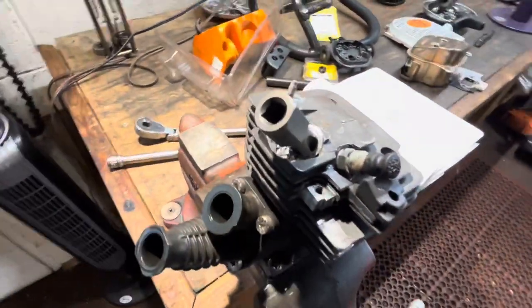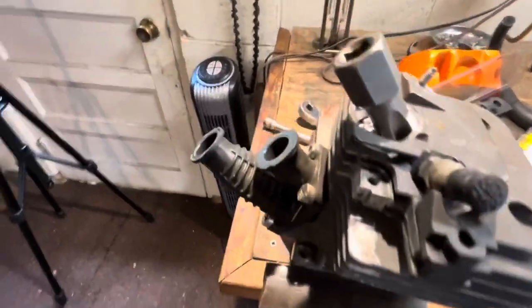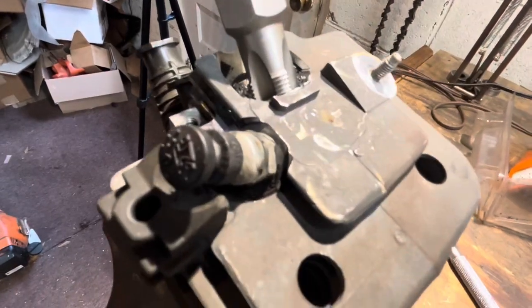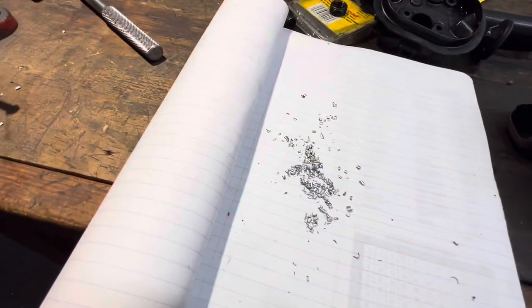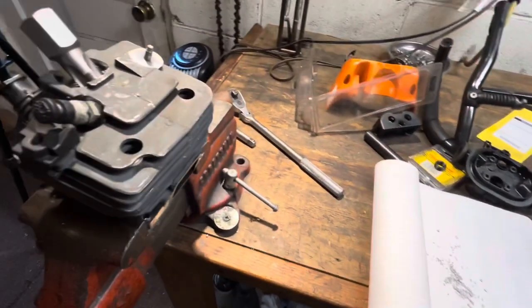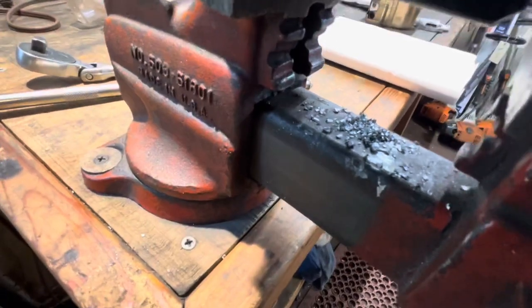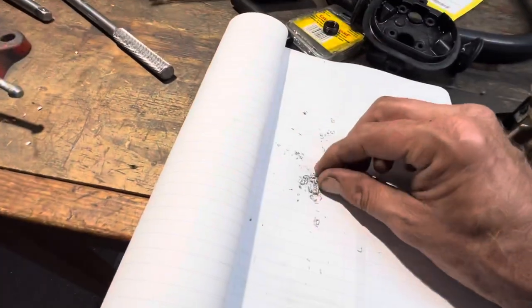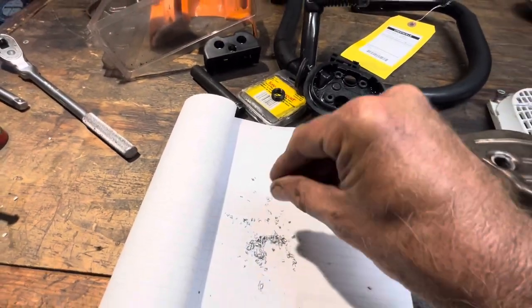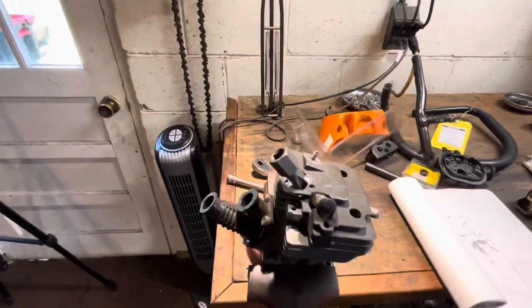I drove that in there. I believe I might be off just a touch this way, but the angle stayed true. For any of you thinking you'll just do this on the saw - I held this underneath the vise while driving the tap in. I'll just put a little dab of grease to catch all the shavings - actually, don't do it. These aren't small pieces, and I know it's just aluminum, but it's your thousand-dollar chainsaw, so keep that in mind.